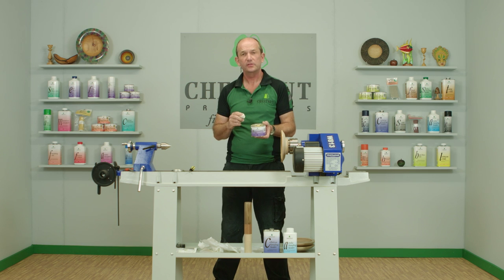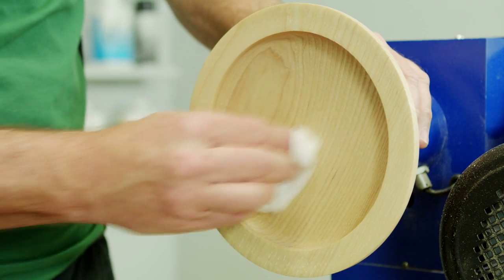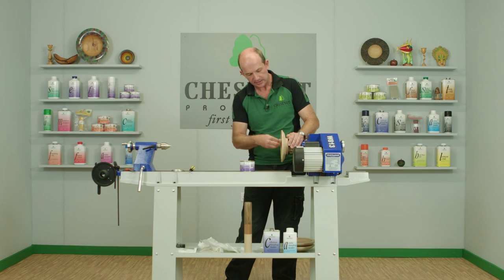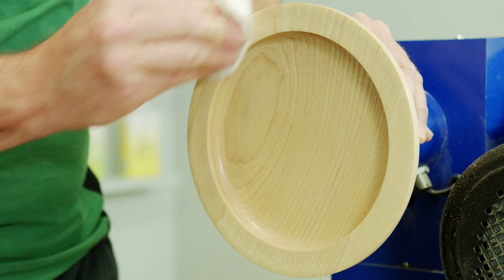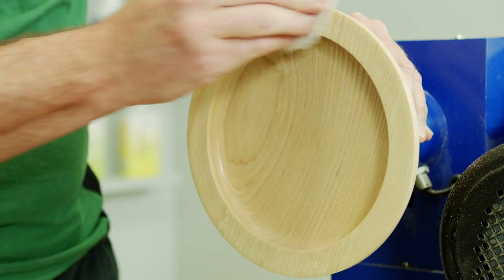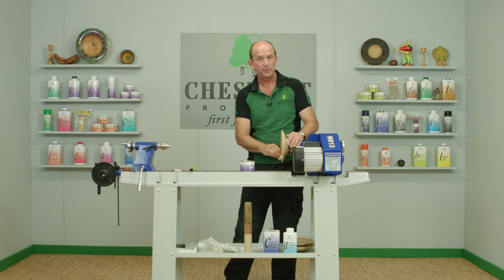It's in a solvent base to make it easy to use and it spreads very well. This is a different solvent to the one used in Wood Wax 22 and it stays wet longer — that's a good thing, because with micro crystalline wax less really is more and you want to apply it in as thin a coating as you can. We get that onto the cloth using the safety cloth, not too much, and spread it as thinly as we can. It stays wet longer, giving you plenty of time to spread it. Because there's a different solvent we do need to leave this one 15 to 20 minutes to dry off before we can buff it up.